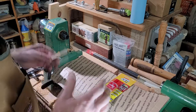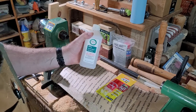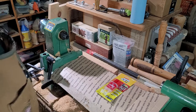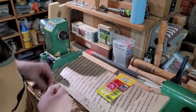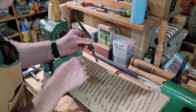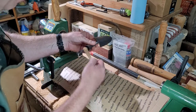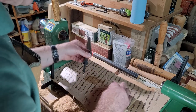Okay, now it's time for the epoxy. One little tip I wanted to give you guys is keep rubbing alcohol around when you're doing your epoxy work. It's perfect for cleaning up the spreading tools or any drips that might happen. Yeah, this tool has a little notch on both sides, obviously to help capture a bunch of the epoxy, but I'm gonna goop this up pretty good.